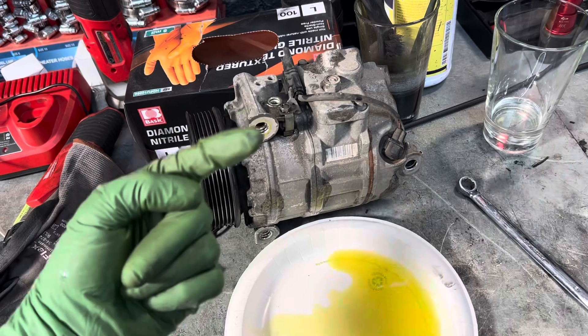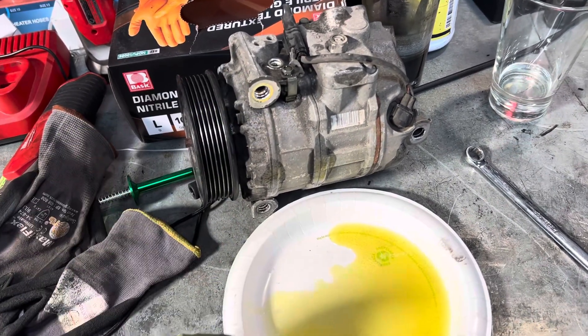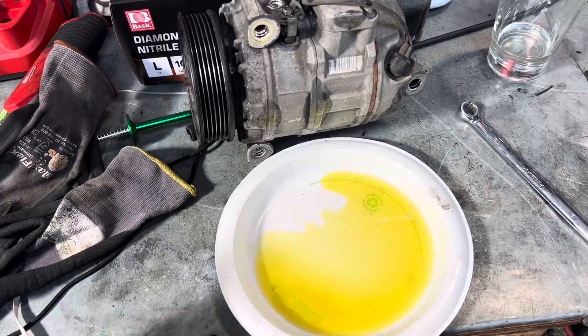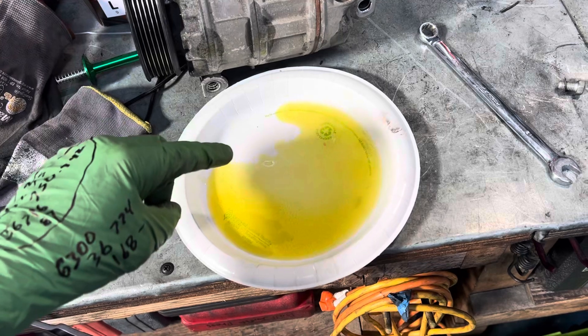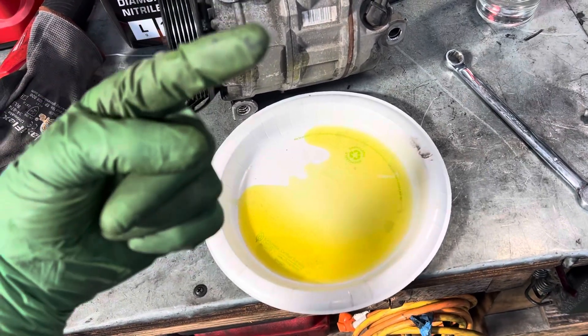It's all up in the evaporator. It didn't leak out — it's in the evaporator. This has a really slow leak on it. We're looking for the leak right now. Right after we put it on, he didn't want to do it before — they need to ship it out. We're going to find the leak and repair it later, that's just a deal he made. So on this one, all the oil is up in the evaporator.